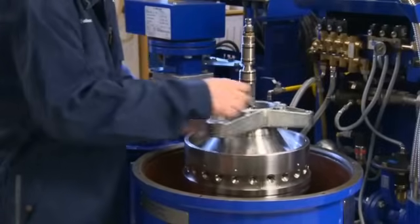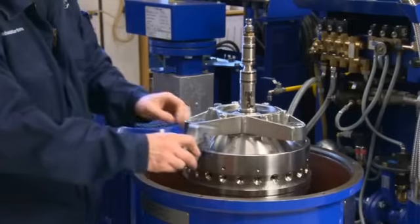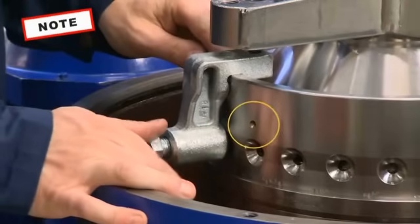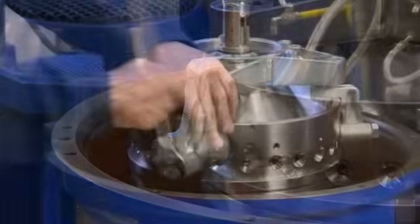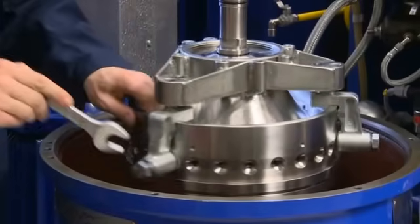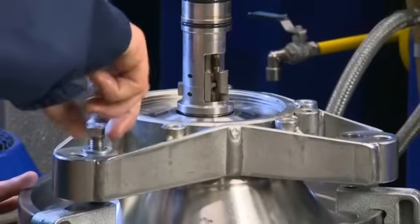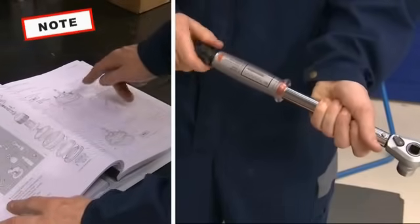We need to use the compression tool to open the bowl. Fit the clamps onto the bowl. Be sure not to cover the threaded holes. The screws will fit into the sludge holes. Tighten the screws into the clamps and check the manual for the correct torque value.